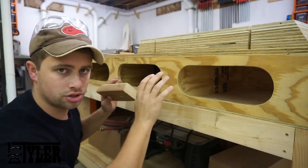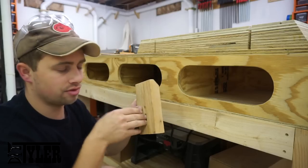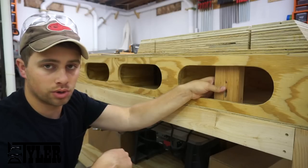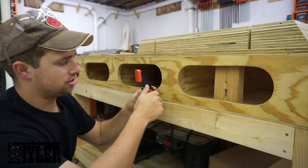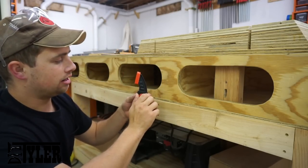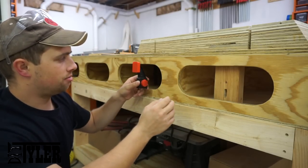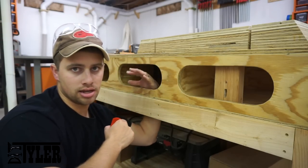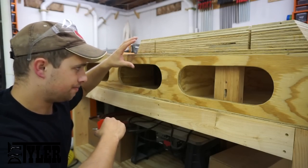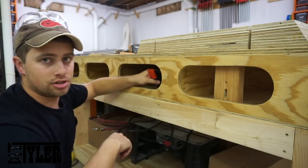How you attach your vise to the workbench could vary for each of the different styles of workbenches. What I'm going to use is a bunch of 2x4 blocks with a slot for the bar to go through, and I'm going to knock a corner off the longest diagonal of this piece so that you can rotate it up and into where you need to be. I tried mounting this upside down but it made the clamps skew a lot when I applied any pressure, so I'm going to mount them both on the inside. I cut a hole in the bottom of my cubby here, which doesn't actually affect the integrity of the workbench at all, so now I can reach through the bottom and adjust the clamp bar as I need to index the vise in and out.